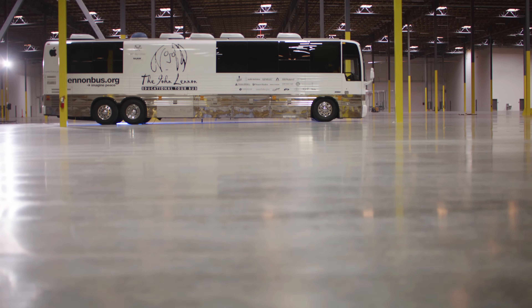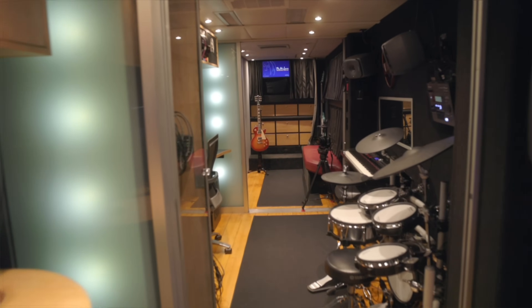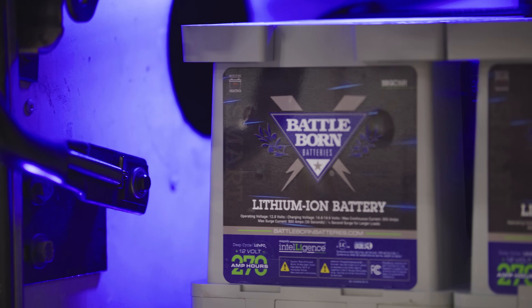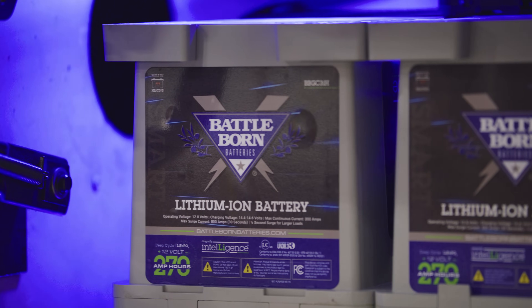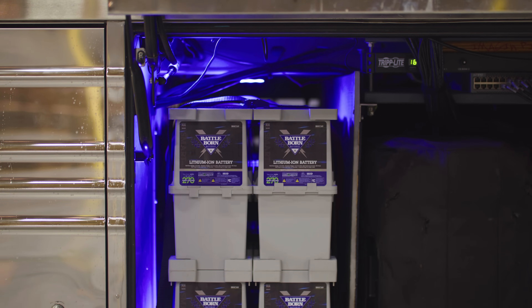The Lennon Bus is a really cool project and I was happy to be a part of it. What it essentially is is a mobile recording studio. Their needs are very specific — having clean power, 120 volts and 60 Hertz for all of their recording equipment is of astronomical importance compared to other applications.